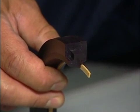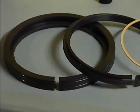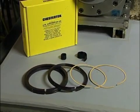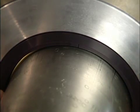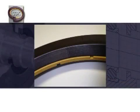The inner and outer adapters are made from our extremely durable polymer material and are difficult to damage during installation. However, be careful not to nick or damage the sealer rings at any time, since they are made from a softer material. As the seal is pressed into the bore, notice the splits start to close together as the seal is worked into the bore circumference. As the seal is evenly seated into the bore, notice the gap between the adapters is barely noticeable. However, by design, once installed, a gap will be visible between the sealer rings. This gap prolongs the seal life due to wear. As the sealer rings wear, the gap between the sealer rings decreases, which indicates that scheduled maintenance of the product should be considered.